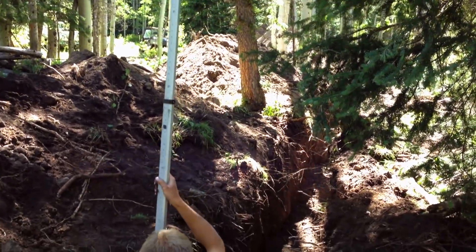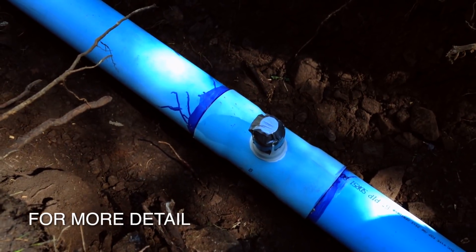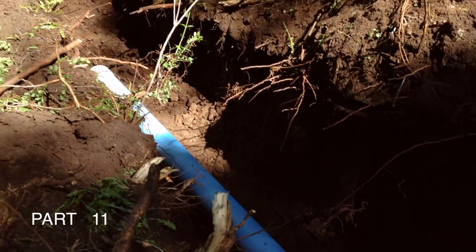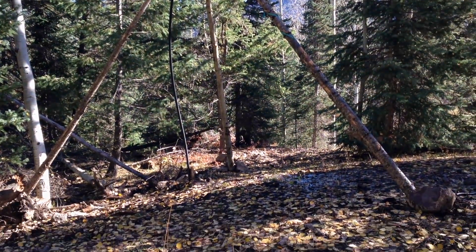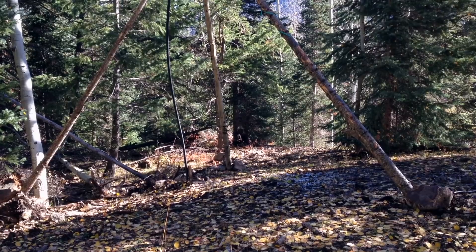Towards the end of the 300-foot pipe, which had a very shallow grade, we installed a fitting for an air vent that would allow any air collected in the pipe to escape before the grade of the penstock became far more steeply graded down the hill. A tripod would later be installed to support a flexible standing urethane pipe which would be able to withstand winter freezing.